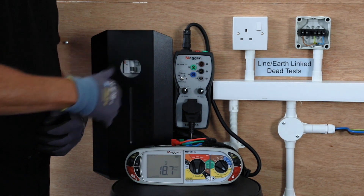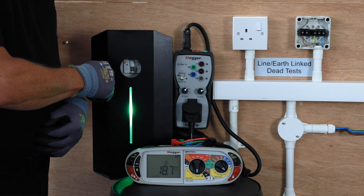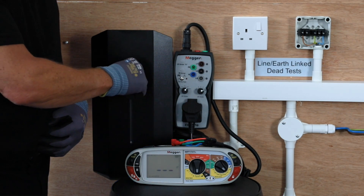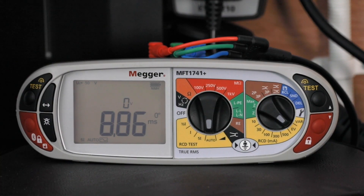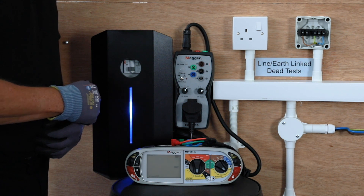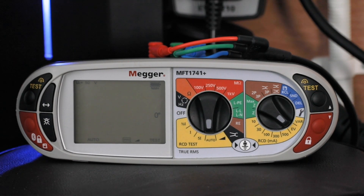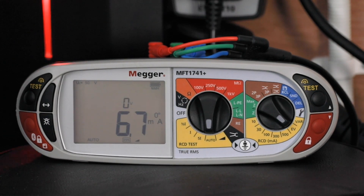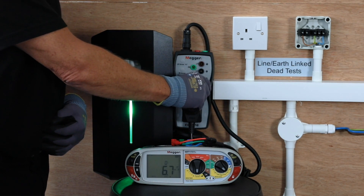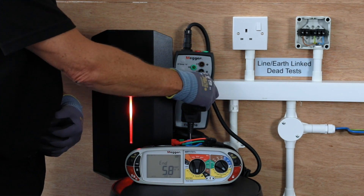Once you've got it back on it will trip almost immediately. Once you get to the DC ramp test it's a lot simpler to reset, simply by returning to A and putting it back to C on the EVCA. It resets it and then goes into the second half of the test.